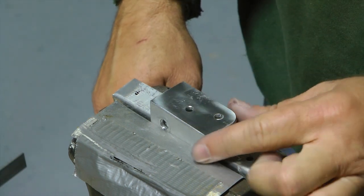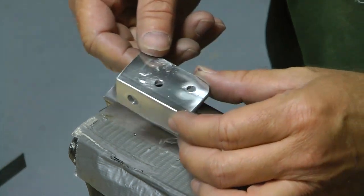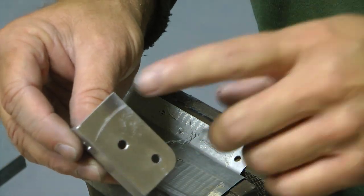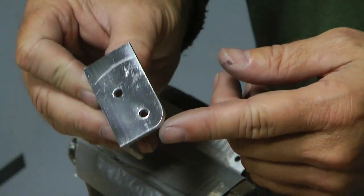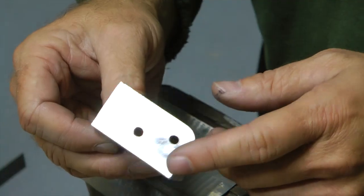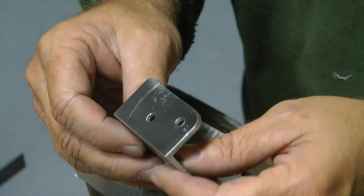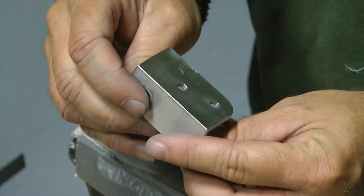Now you could spend more time and get some of the scratches out and make it even shinier. But you can compare the part I just did with the original side and there's quite a difference. Literally with a few seconds of time you can really make your parts look wonderful. Rounding your corners takes about 15–20 seconds, and shining it another 15–20 seconds. It doesn't take much with Scotch Brite — whether it's in pad form for polishing or the wheel grinder for more aggressive removing of material. Does a very nice job for your parts.